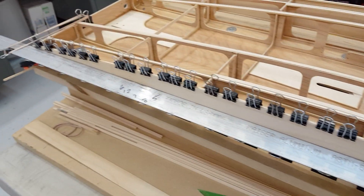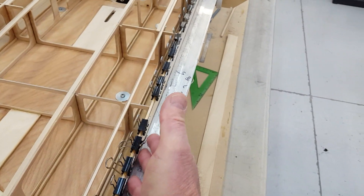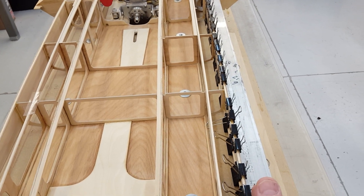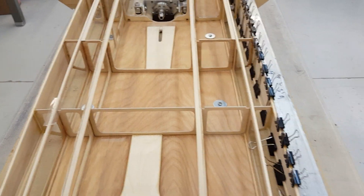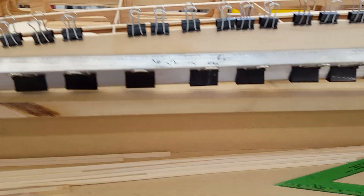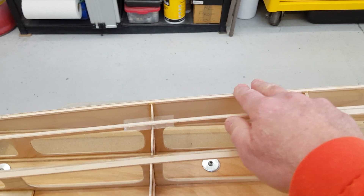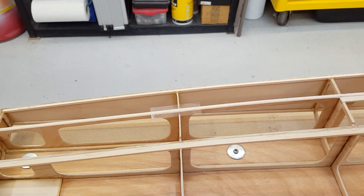As you can see I'm binder clip crazy. This side has just finished setting up so it should be fine, but you want this guy mounted nice and straight on here. You'll see some boats - not passing judgment, I've done this - where there's kind of a waviness to the deck. I like the stuff to be nice and straight, so that's why I attach a straight piece here. You can see there's a piece of angled aluminum clipped onto this piece.